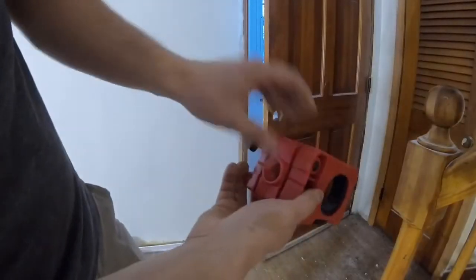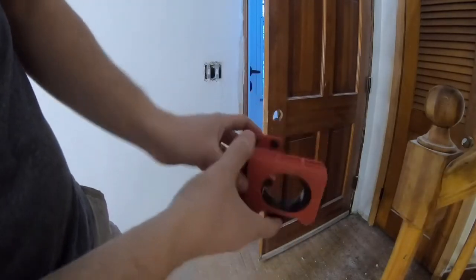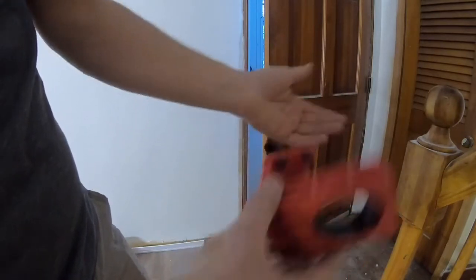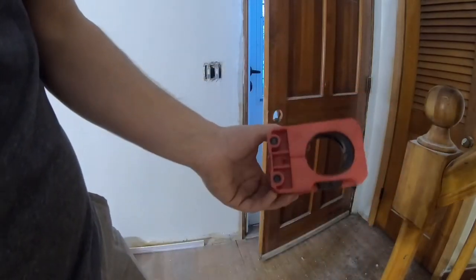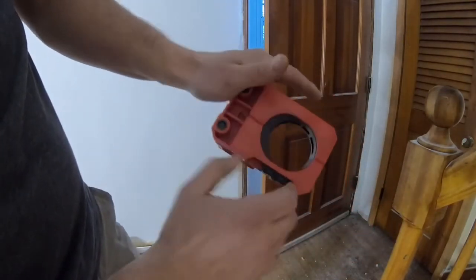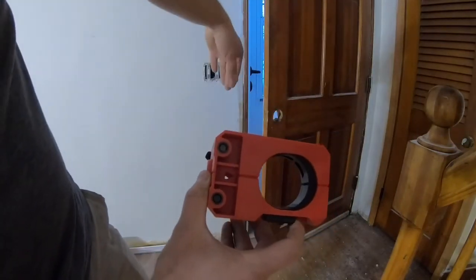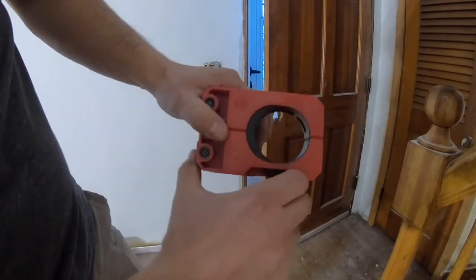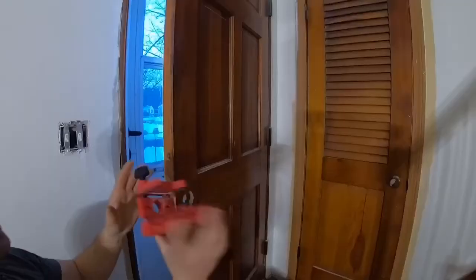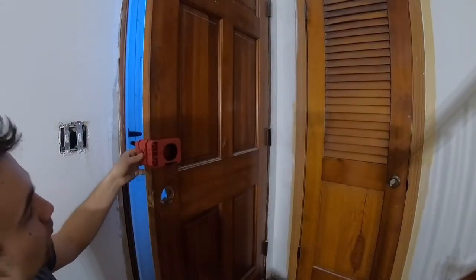This part right here. You're going to be drilling one hole for the latch and one hole for the handle — this is where the door handle is going to go. These kits make it very easy; without this kit it's probably not worth it, because these kits are so cheap. This one was only $29 and you can get them as cheap as $15 from a hardware store. This kit also has the option of positioning the lock closer to or further from the door jamb. The standard I've noticed is the closer position, but let's get started.